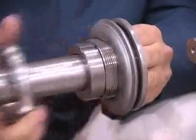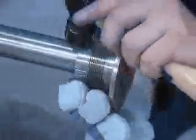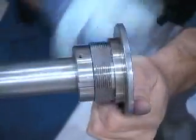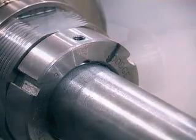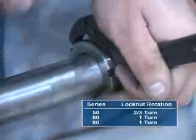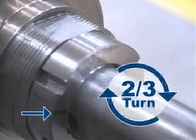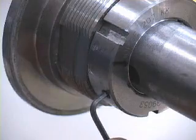If the bushing will not fit over the shaft, rotate the bushing lock nut counterclockwise to expand the adapter. Once the flange is in place, rotate the grip tight lock nut clockwise by hand until it is hand tight. Tap on the OD of the nut while turning to assist with this procedure. At this point, the bushing should not be able to be moved axially or rotated by hand. Scribe a line on the lock nut above the slot in the adapter. Rotate the nut according to the procedure described in the instruction manual using a spanner wrench or brass drift and hammer. Use the line positioned relative to the adapter slot to determine how far the nut has been rotated. Finally, tighten the set screw in the lock nut until the allen wrench bends. Now you're ready to continue with installing the element as previously shown.